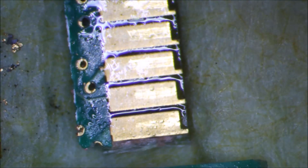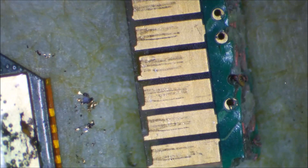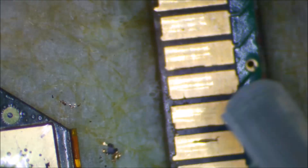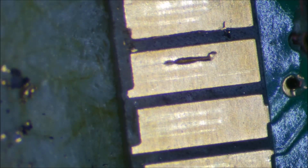The hard gold sample — I tipped it over during the time lapse to put some acid on the other side as well. There's definitely no ability to scratch anything off on this side. You can see the wear on the other side was quite deep. Even where it was worn and the acid could get to the base metal, you don't really get much happening. Even with a scratch right through, you have no chance of actually scratching off a foil — it's going to take a lot more time for the acid to work its way around the gold.